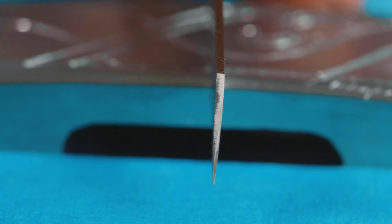We are engraving side A on our upper guard of a Viking sword. I'm completely fresh to trying to engrave and trying to inlay. This is brand new to me, so it's a pleasure to bring you along for the journey, and I hope you enjoy, because we're about to take our freshly made onglet graver with a 35 degree heel and cut some undercuts, ready for us to inlay some gold.